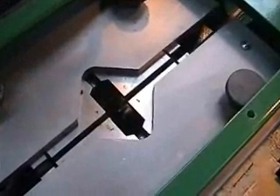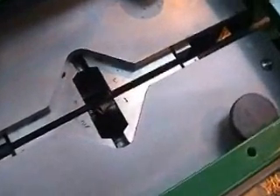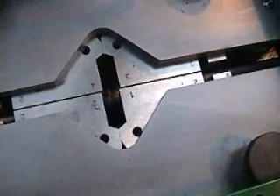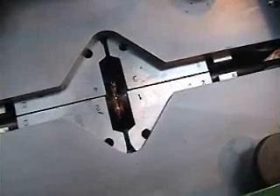The rod is passed through each side of the die until it can be seen at the centre of the die. A weld cycle is started by depressing the foot switch. Four to five weld cycles are normally sufficient to implement a successful weld.